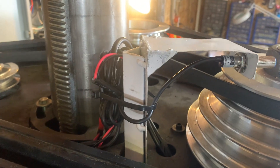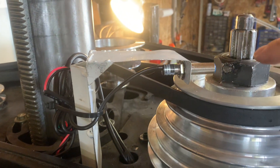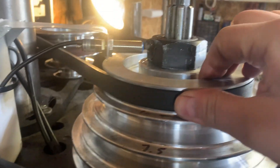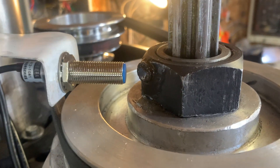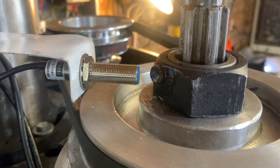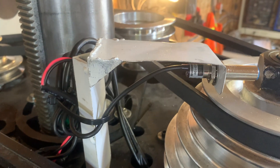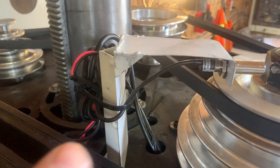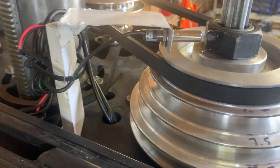I made a homemade bracket using 22-gauge sheet metal because the sensor has to be within at most 12 millimeters from the target. I calculated this and it works — the instructions actually call for a fraction of that but I wasn't comfortable having it quite that close. The bracket consists of 22-gauge sheet metal with the appropriate bends, a couple of screws, and I welded an angled bracket to stiffen up the vertical riser so it's nice and sturdy.